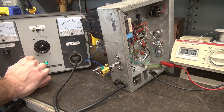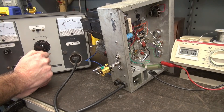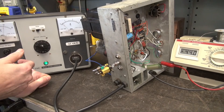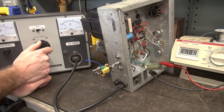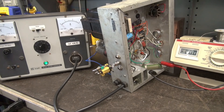You can see we're pulling current. The good thing to do is let the current come up and make sure it stabilizes — if it just keeps going up and up, you've got something wrong and it's time to turn it down. We're stabilizing around 37.5 milliamps at about 80 volts. There's 100 volts. The bias resistor is maxed out at around 500 ohms, but I can decrease that and pull more current if needed. There's full voltage — the 807 looks happy at about 49 milliamps.